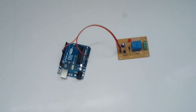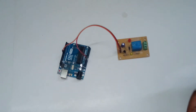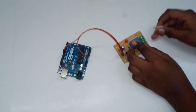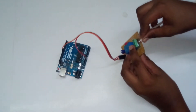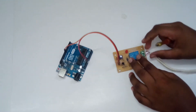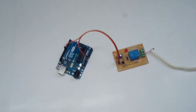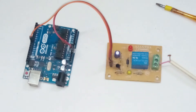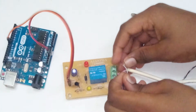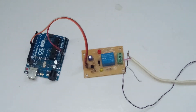After doing the basic connections, we now have to connect the USB. I am going to connect the positive terminal of the USB male port to the center pin, which is the common pin of the relay. Then I will connect the USB female pin to that connection, and before that I will solder these connections and tape the wires.